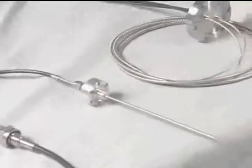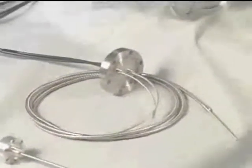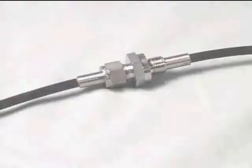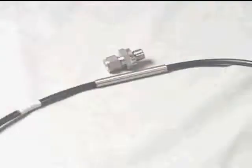When fiber optic cables are installed in the vacuum space, there are several pass-through configurations to choose from. In rough vacuum, the fiber optic vacuum pass-through FV-1 works well. A solid section is included on the cable. The fiber optics pass through the section and are potted in. A compression fitting seals the OD of the pass-through.